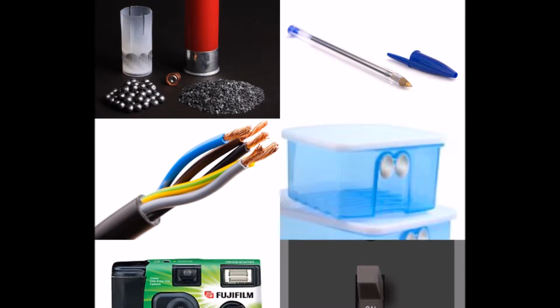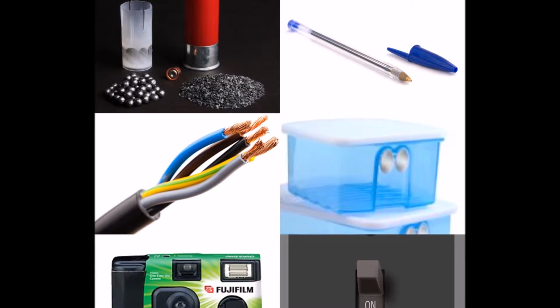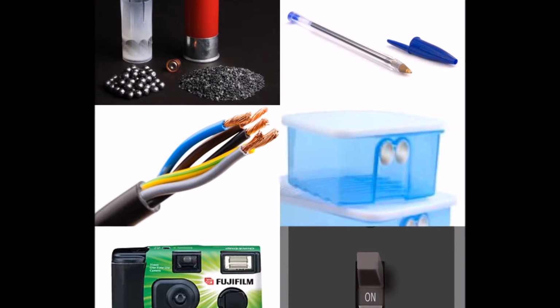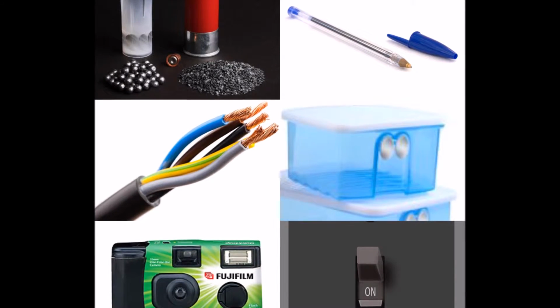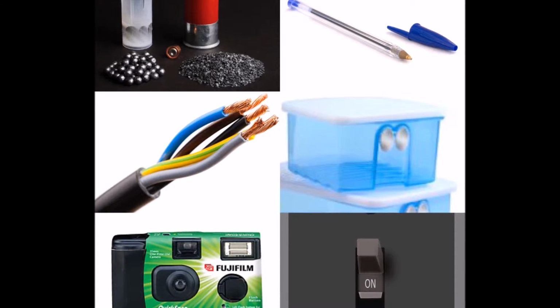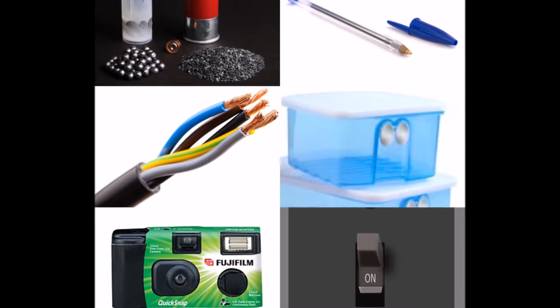The materials used to make our coil gun include a circuit board from a disposable camera along with 2 extra capacitors. We took apart an ink pen and used the outer cartridge as our barrel. We attached 2 washers to the pen cartridge to hold the coil in place. Next, we stripped telephone wire and wrapped it around the barrel between the 2 washers to make the coil. For ammunition, we took apart a shotgun shell and used the steel pellets.